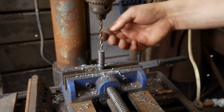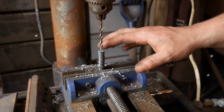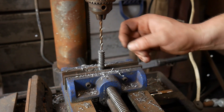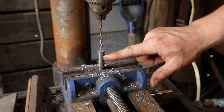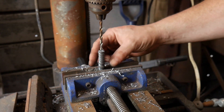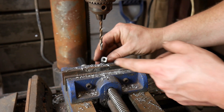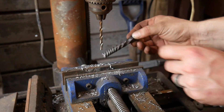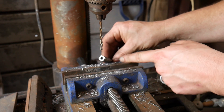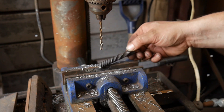And there we go — now we've got a hole drilled, and this is going to come out nice as multiple beads. What we're going to do now is cut these off in roughly 3/8 inch, or 9.5 millimeter, slabs — just slab this out and cut it off like you were cutting logs for the fireplace. You can see we've got all these little bits that would have been really fiddly to put in the vise and try to drill one by one. Now we've pre-drilled a bunch at once and all we've got to do is slab-cut these off and we're almost finished.